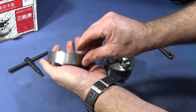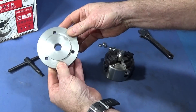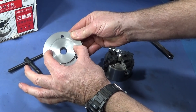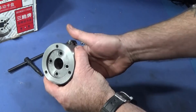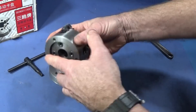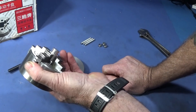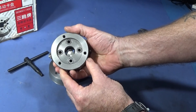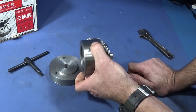Off camera I did most of the turning work — facing off and turning — and I'll be picking up where I'm doing the register, with a special trick to show you how I can quickly get the register to the rough size. Then I'll show you how to use transfer screws in the back of this chuck. You only have the threaded holes for the six millimeter allen bolts that come with the chuck — there are no holes through the chuck — and I'll show you how I use my homemade six millimeter transfer screws to actually get the PCD of the holes.